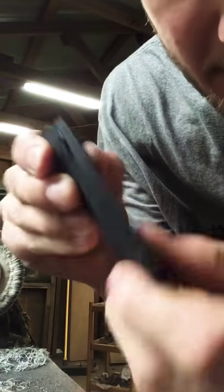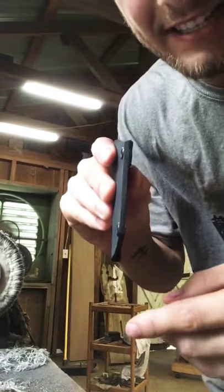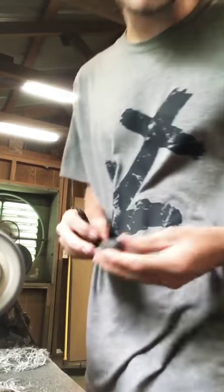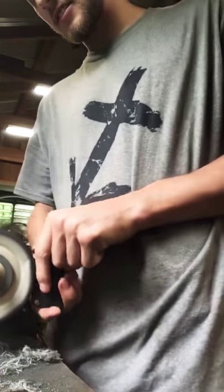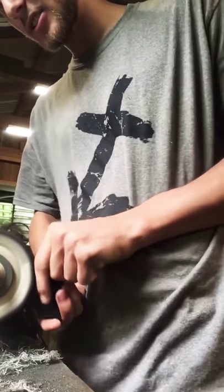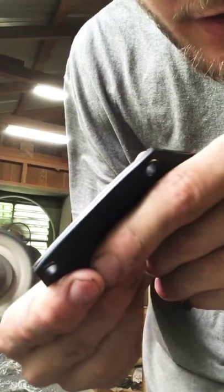It's time to clean up the edges since I did that with a 60 grit. I know a lot of makers probably hand sand this, but I just go straight to the buffer using this black compound and it seems to polish it amazingly. If you can see that, that's 60 grit — and in a few seconds I'm going to take that to a crazy polish. Look at that. Yeah, that's my secret.